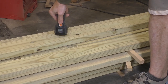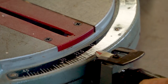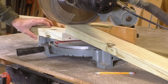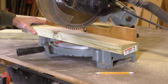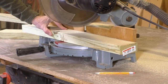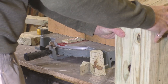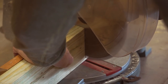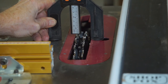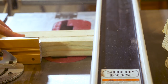When I bought this pressure-treated lumber about four months ago it was really wet. Now it's about 6% so it's ready to be used. I'm starting with the base and setting the angle on the saw to cut at 19 degrees to match the pitch of the roof. I'm going to build the cupola in three sections so I'll be able to carry it up onto the roof. I'm cutting a 19 degree miter for the bottom of the leg and a 90 degree cut on the top, and a 19 degree bevel on the bottom of the other part of the leg. I'm going to use a whole bunch of half lap joints, so I'm setting my dado set to the right height to cut halfway through the 2x4s.